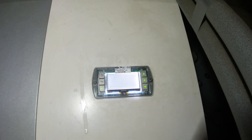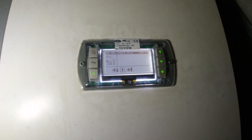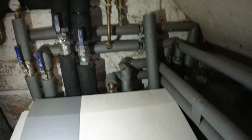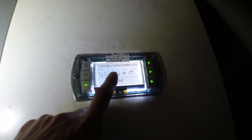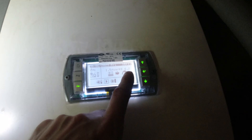It takes a while to boot up — comes on, then it asks what language you want it in. So that's booted back up now — no alarm. I'm looking at the brine pressure; it has dropped a tiny bit possibly, but I think that was just from removing the connection. If you look at the active demands, it is doing my domestic hot water — it's heating up the water. It's using 1.5 kilowatts to generate 8.5 kilowatts of heat, which is an efficiency of about 600%.